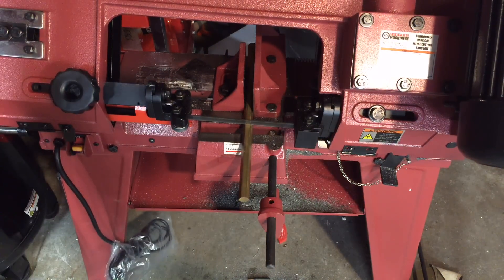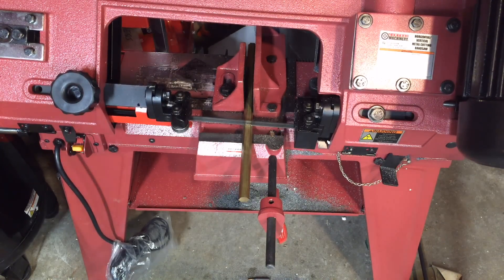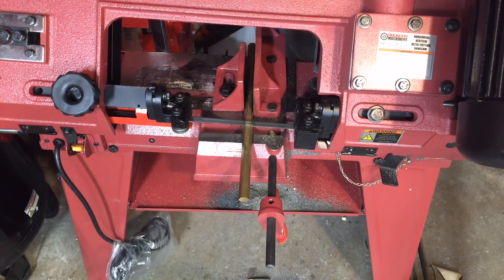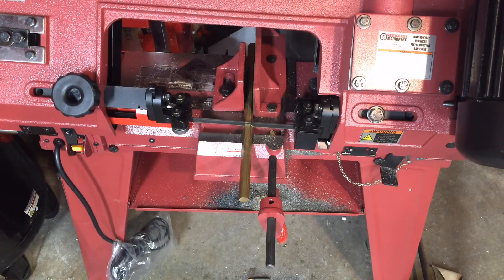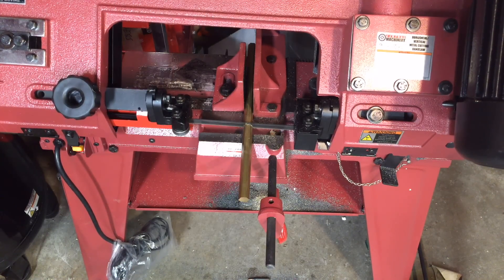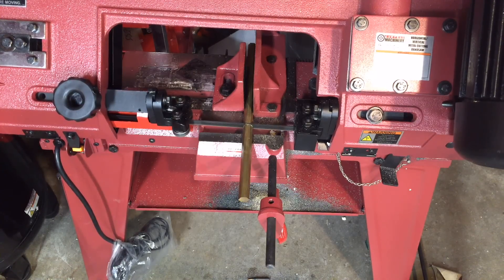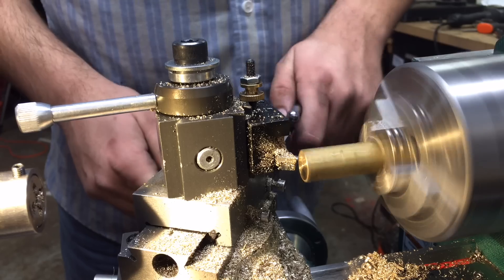With the body done I can start working on the actual bolts. I'm going to make these out of brass — this is half-inch brass hex stock. This video is not sped up at all; it only took about 40 seconds to cut this on the bandsaw. Half-inch is a little heavy for the head of a quarter-inch by 20 bolt, but I really wanted that extra weight and the brass — it'll help with momentum when keeping the spindle going, especially at lower speeds for certain operations.